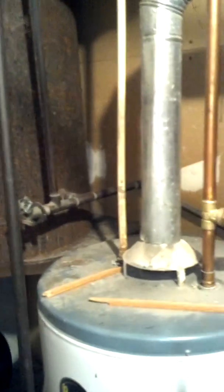The line coming from over behind the wood stove on the other side of the brick wall goes up and over, feeds into the top of that tank, and then there's a line in the back that goes down and also connects to the back of the wood stove. That tank will get hot just from running the wood stove.